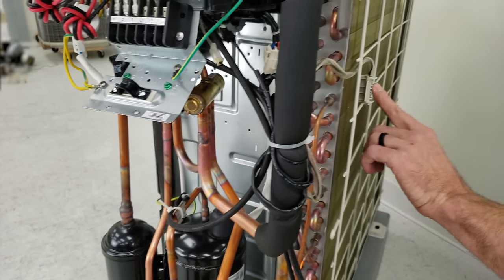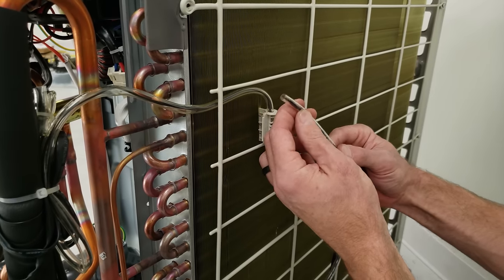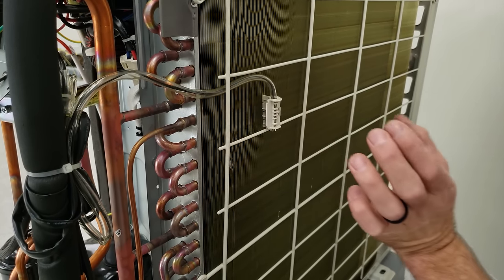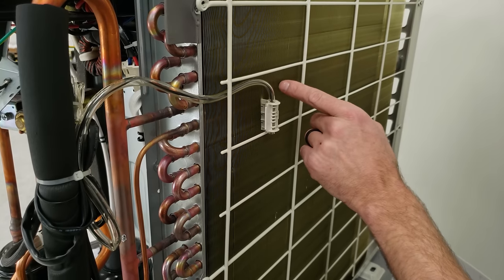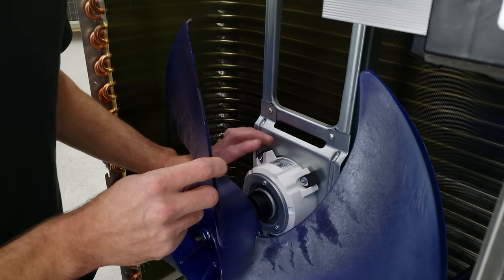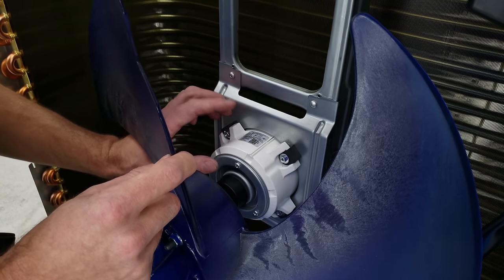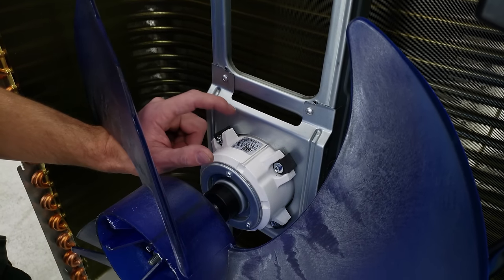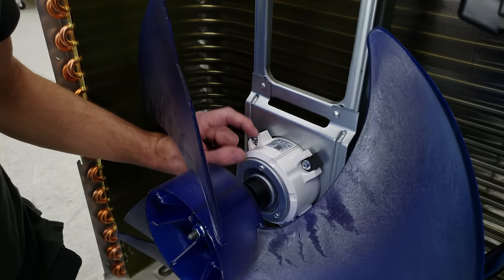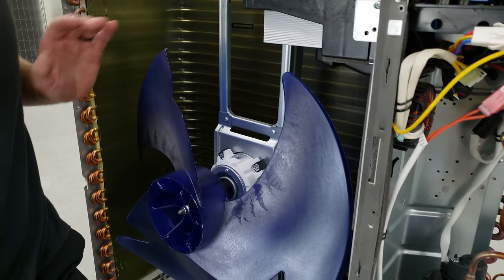There is also a K-type temp sensor shielded with clear poly tubing that monitors the outdoor air temperature — the air coming across this coil — measuring it before the air crosses the tubing, either absorbing heat from the refrigerant or transferring heat to the refrigerant. Here we have the outdoor unit fan motor, wound as a three-phase motor with three wires. It receives a pretty fixed voltage but a changing frequency, just like the compressor — the lower the electrical frequency from the IPM board, the slower the fan runs; the higher the frequency, the faster it runs, changing airflow across the outdoor coil.